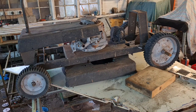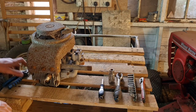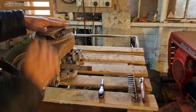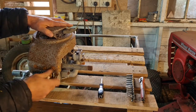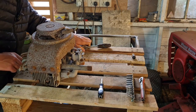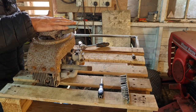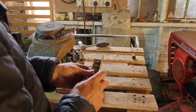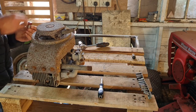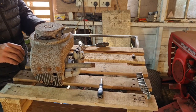I'm going to get this engine on the pallet stand and see if we can get a spark out of it. Let's get the plug out — oh, the plug's had some hard life, I think it's buggered. Now I want to get the top cover off and give everything a blow out and oil up. These bolts are 11mm which is unusual — they are extremely tight. There's a fuel tank missing off there as well, but that's a standard Tecumseh mesh tank and I'm pretty sure I've got one somewhere.